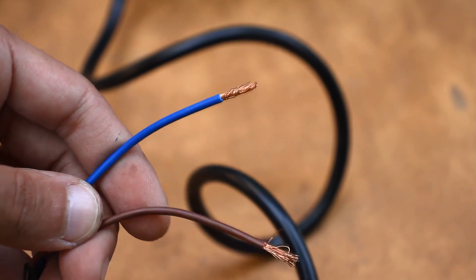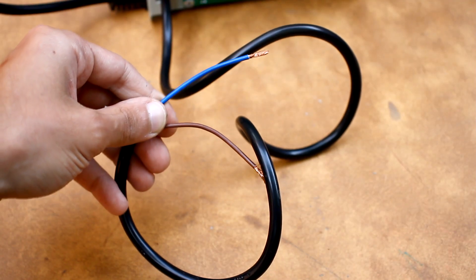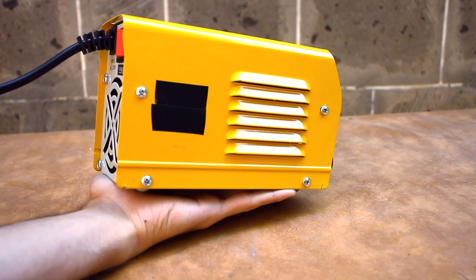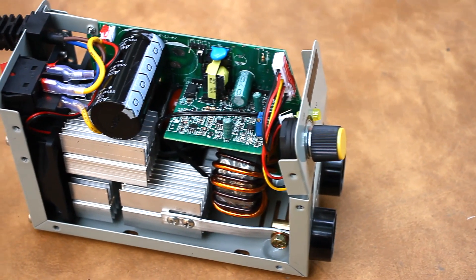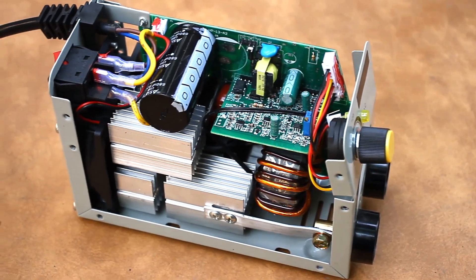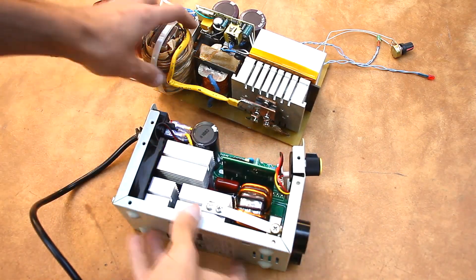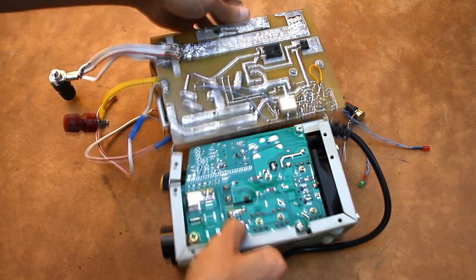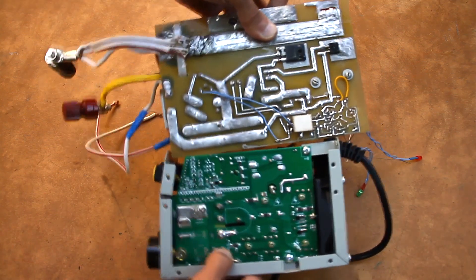The main wire is copper with no identification marks, but apparently the cross-section is about 1.5 mm² or AWG15. Now we will study the stuffing of this unit — I am anxious to see what the Chinese put in there. I honestly expected it would be much worse, but here is a full-fledged inverter, only in miniature. I thought my homemade inverter was quite small, but the Chinese board is half the size of mine.